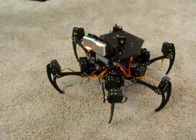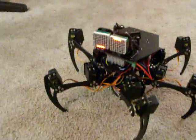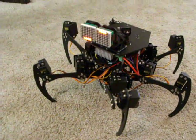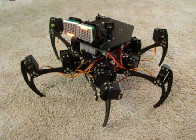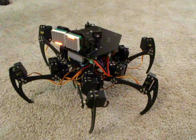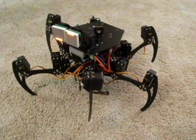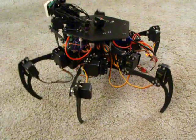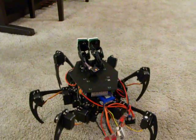I have more work to do but I think it's kind of cool. There are 18 main servos and also four servos controlling the eyes. I have a 2300mAh LiPo in it, rated at 40C so it can output a lot of current. I have two 15-amp regulators dropping the voltage down to about 5.2 volts to be safe, and it's also powering the LEDs up front.